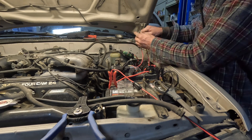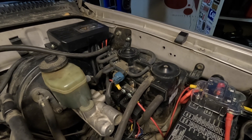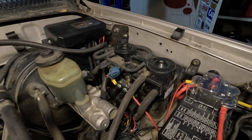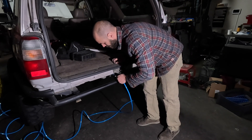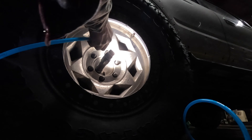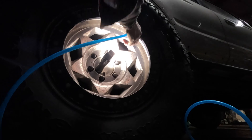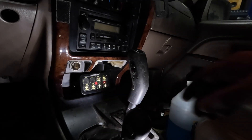I'm going to do my best to explain what the problem is. Essentially, I have two pressure switches — a high-pressure switch and a low-pressure switch. As the pressure gets close to either one of those, the relays start cycling. That cycles both the dump valve and the compressor itself, and it cycles for five or ten minutes. That is really going to damage the compressor and also very quickly damage the relays that control this system. So ultimately, it's just not going to work.